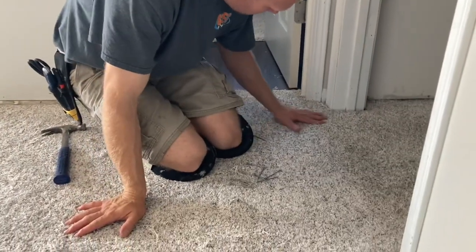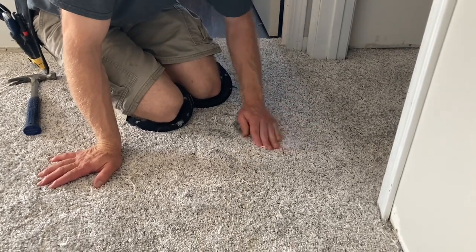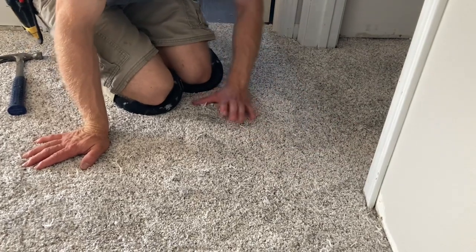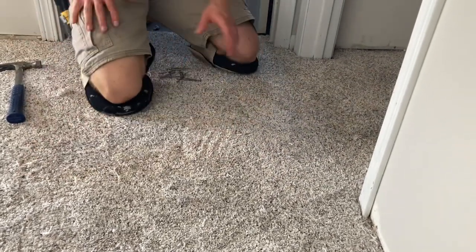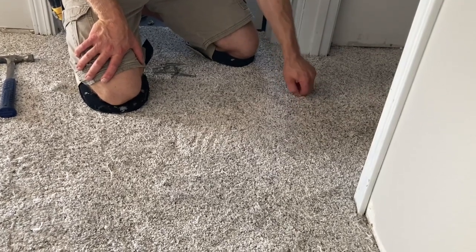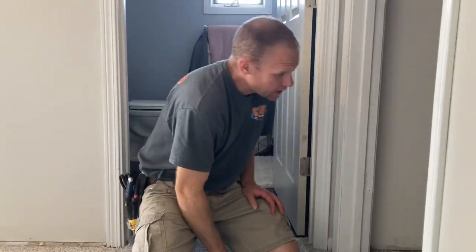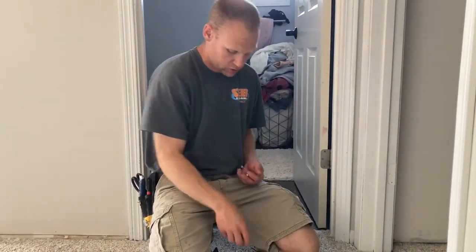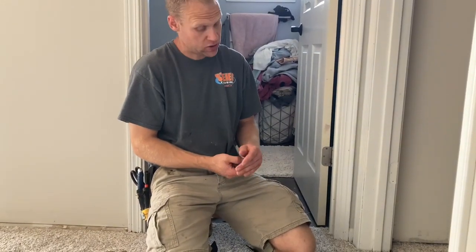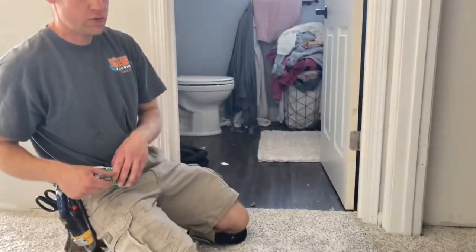Very important. Take your hand and let your hand find a nail if you left one. You don't want that customer's foot finding one. So we got that done. So now we're in the door here. Let's do our stretch test. Look at that. Pop, pop, pop. Just popping down. So that's good. And that's going to obviously be a well-trafficked area. So that backing, just from normal wear, might soften up a little quicker than the rest of this carpet. So we've got good tension on it, and we hope that our customer has no problems with it in the future.